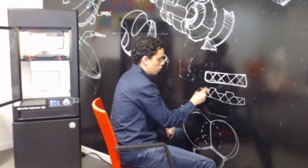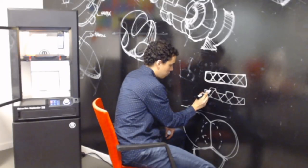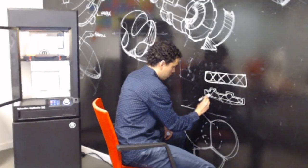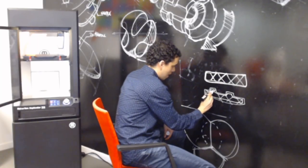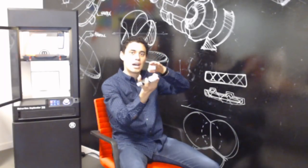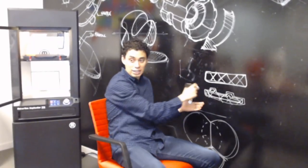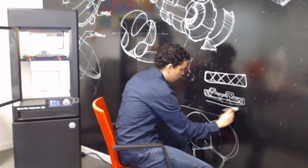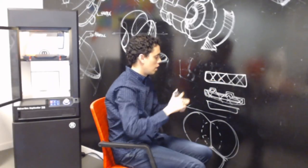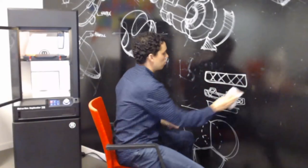However, the solution for this was to increase the number of shells, and I'll try to do it fairly exaggerated here. So that would be my two shells. At three shells in this case, the dimple is almost gone. And there is a point at which, depending on the height of the dimple, it is invisible to the shells. So the innermost shell is going to perform almost the same way as the original one. It'll transfer the load linearly and directly, jumping and skipping the dimples themselves.